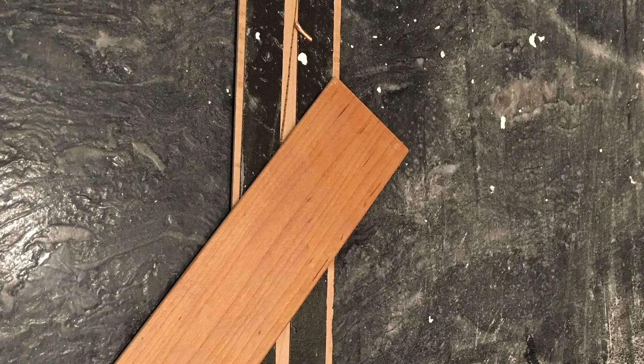I was recently walking a multi-family job site under construction when I ran across a peel-and-stick wall that had just been installed and was already peeling away. The reason I think the adhesive was failing was because it was in a hot and humid space, and it was on a construction site with constant dust. I would recommend waiting until a project is climate controlled and almost finished before installing peel-and-stick.